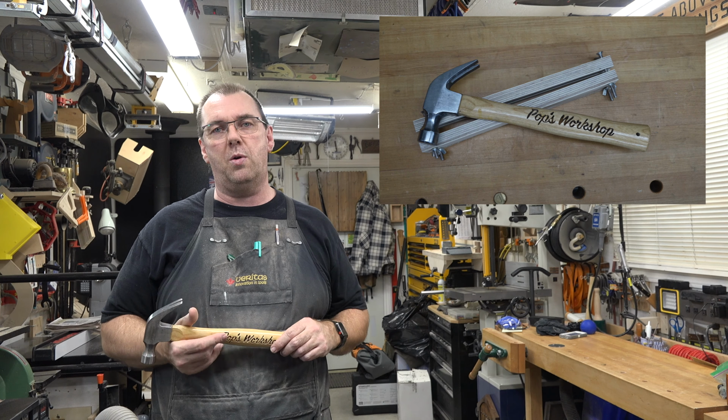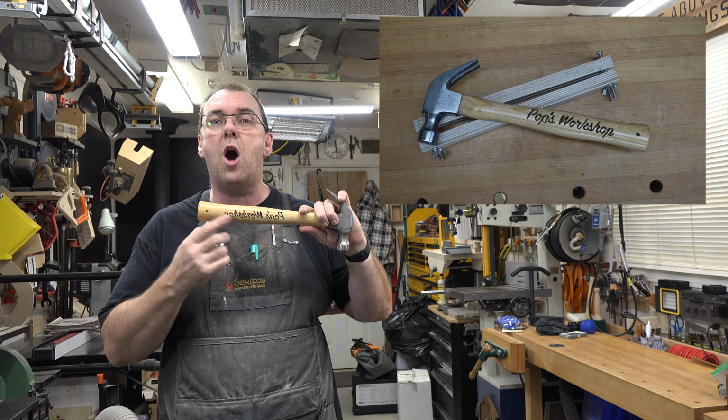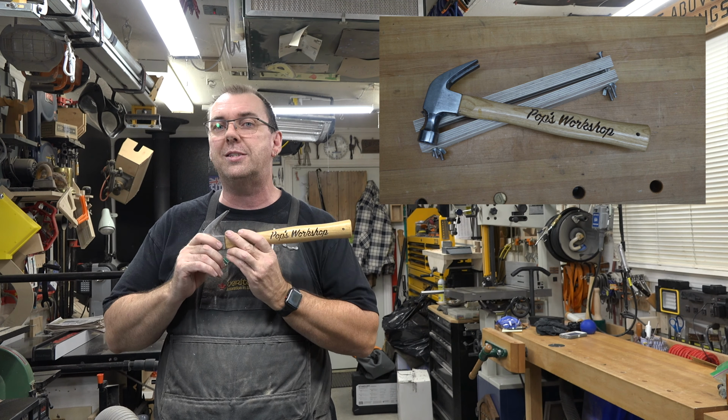If you can see by taking your time, the front looks exactly like the back, except in reverse. And it should. And that's how you can tell whether or not you're cutting too fast. If this suddenly starts to distort and not look like this side, you're putting too much pressure on that blade and you're not letting the saw do its job. Simple as that.